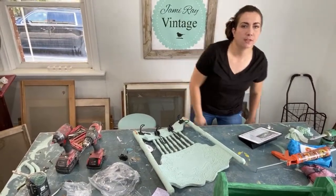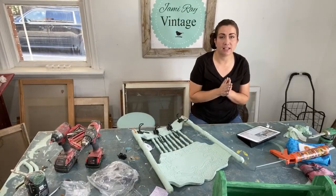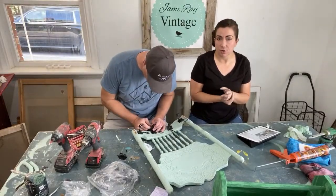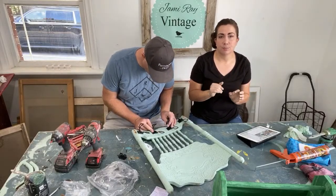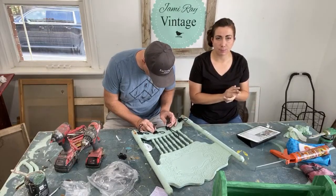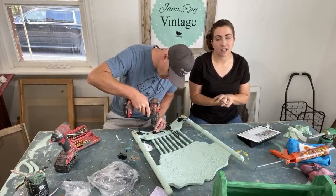Can you tell me about my paint? We're using DIY Paint — it's an all-natural clay-based paint that sticks to almost everything. It's a little bit thicker but you can water it down if you want to. I like to brush it on thick because I like good coverage, then sand it smooth. It has to be sealed with wax or a liquid water-based top coat — I like Big Top or Sweet Pickins top coat. Most importantly, it's all natural and sticks to almost anything.